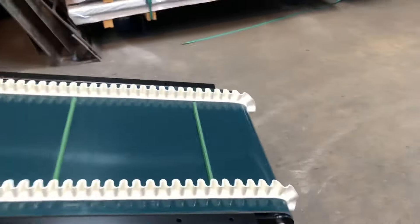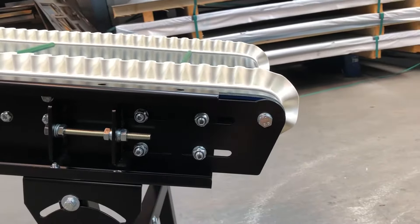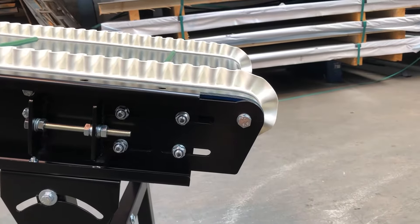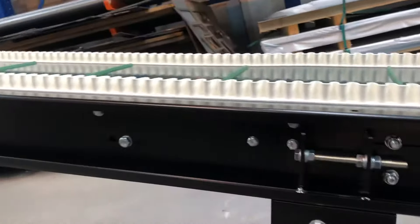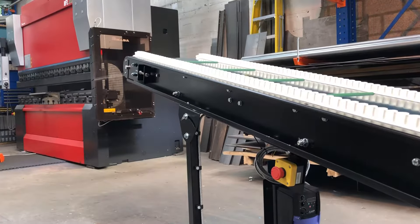On this conveyor, they're actually transferring from the conveyor with a smaller diameter 50mm roller, so what we've just done there is we've mapped that on the end plate. We've got a 50mm transfer roller as well, so it comes in there onto the belt conveyor. And by the time it gets to the top of the conveyor, it'll just drop out into a parts bin.